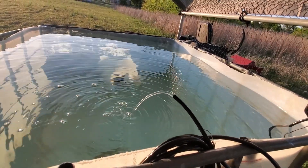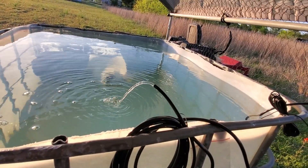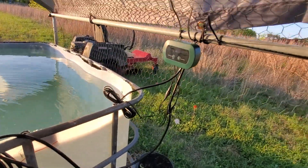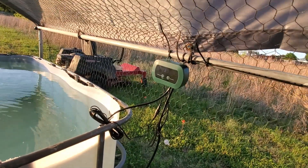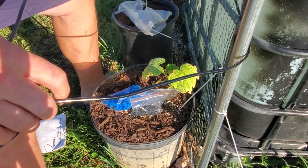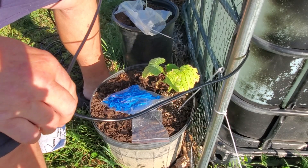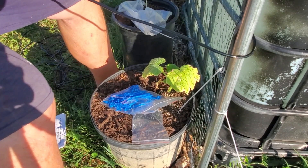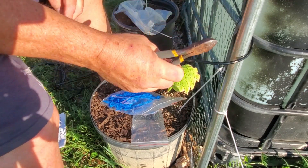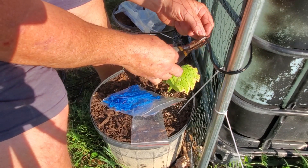Not a lot of pressure — but you don't need a lot of pressure for drip irrigation; it'll be enough to flow all the way through the line. Now it's time to hook up the pots. We are all set and ready to start installing all these lines into the pots. The first thing we're going to do is cut this line coming from the pump going into the first pot, because we're going to be splicing into it and going on down the line.